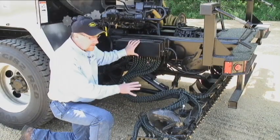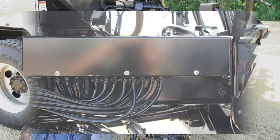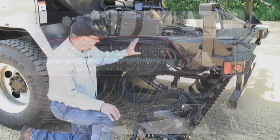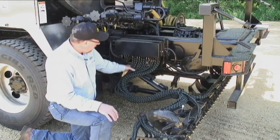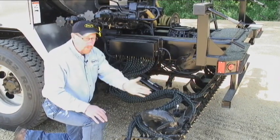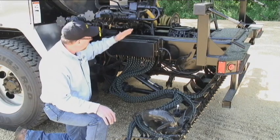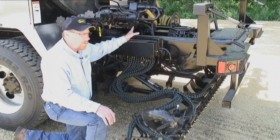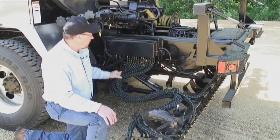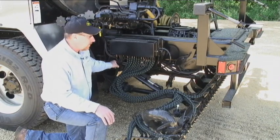What we have on this frame rail is what we call our air solenoid valves, which will control all the air cylinders on the back of this truck. These hoses will start from the middle of the spray bar and work themselves out all the way across the bar. The first few hoses right here will control your other air functions — your four-way valve, your suction valve, your front suction valve, your suck back, and your power return valve.